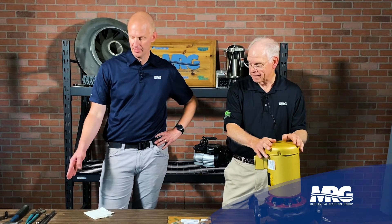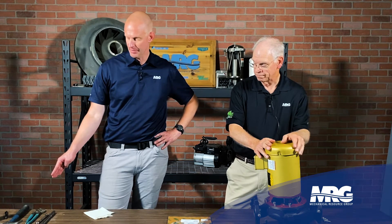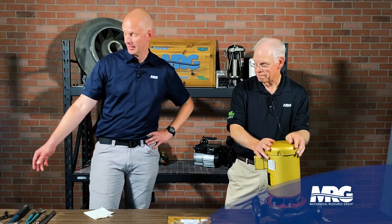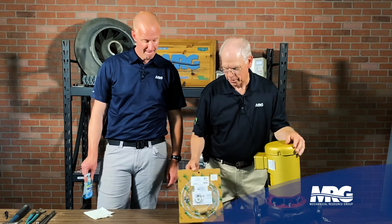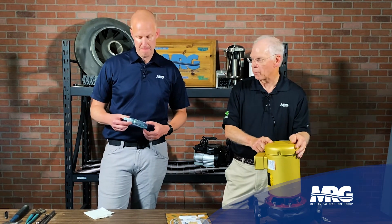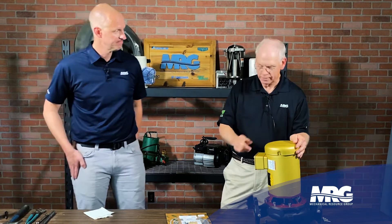Your tools: paper towel, socket set, wrench, hammer, and an adjustable wrench. The shaft seal kit comes with a lubricant — it is a non-petroleum-based lubricant. A big thing about these seals is people sometimes use the wrong lubricant, or even the oil in your skin can leave a fingerprint on the seal surface, and that print creates an avenue for water to leak out. Just touching the seals with your hand can cause leakage. Simple dish soap — if it'll clean a duck, it's great for a seal.